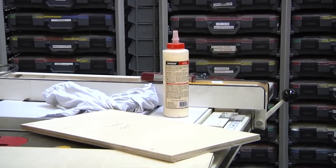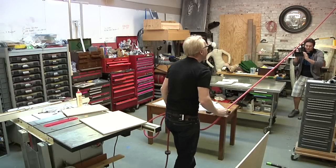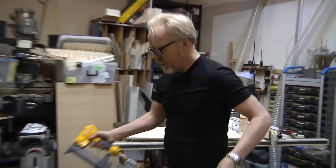What are you using here? I'm using a nice finish ply, often referred to as thin ply. It doesn't have any voids, it's got a nice finish on both sides, and it paints really well. Because it's multiple-layered — you can see it's got like eight layers there instead of normal plywood which is like three layers — when I glue and staple it together the staples won't split apart the side of the plywood.